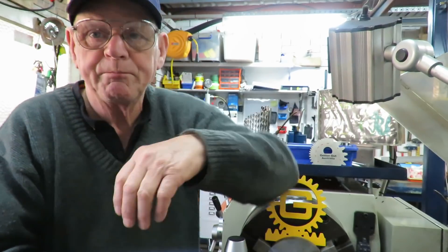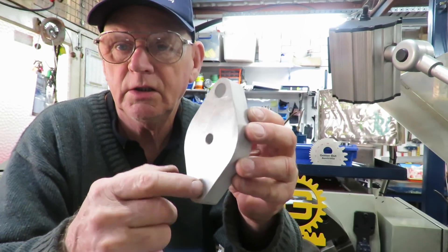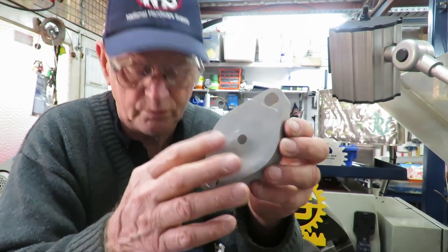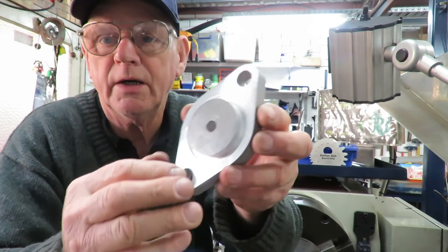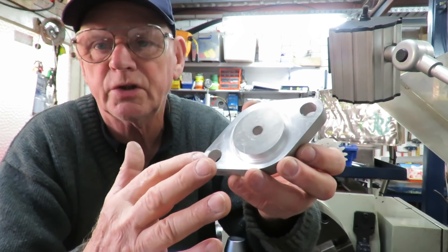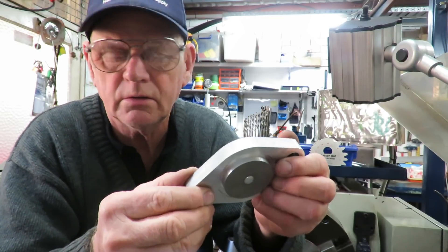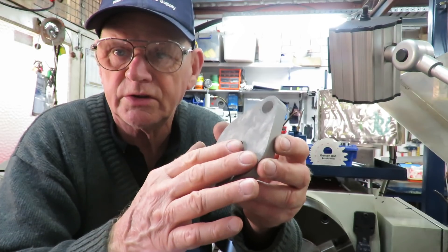So what we have is these flanges. These are part of a test kit, and these flanges I've had water jet cut with the right size hole on the outside where the two bolts are going to go, and just a pilot hole in the centre. What I have to do with those is produce a counterbore inside there for an O-ring. So I have to face off to depth to produce this plug, and then after that counterbore it for the O-ring seal.